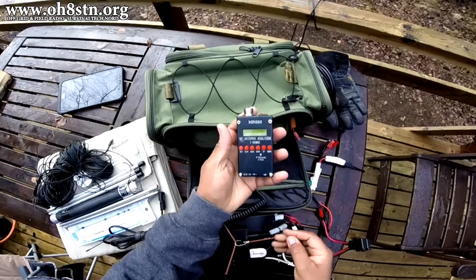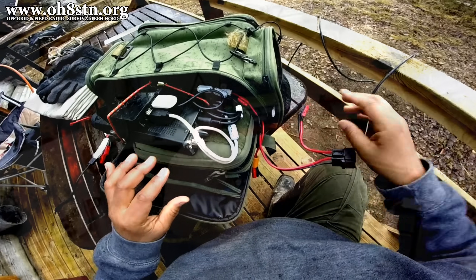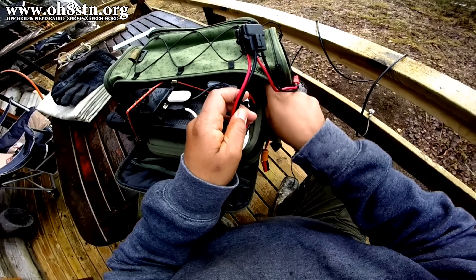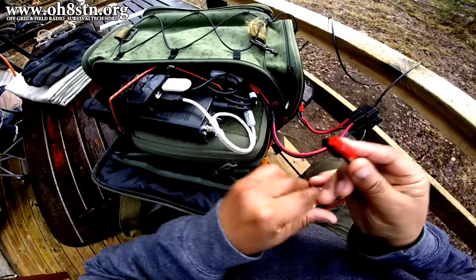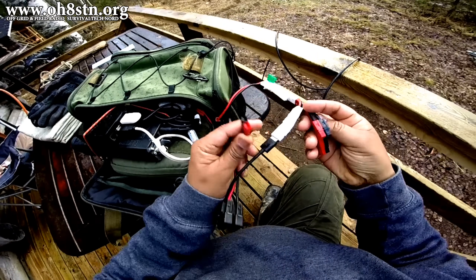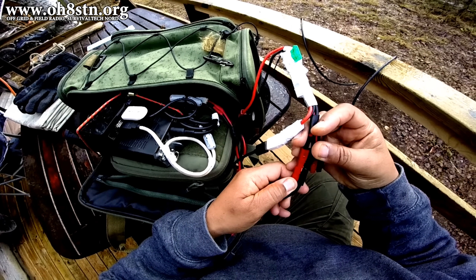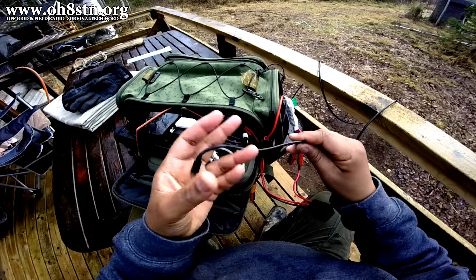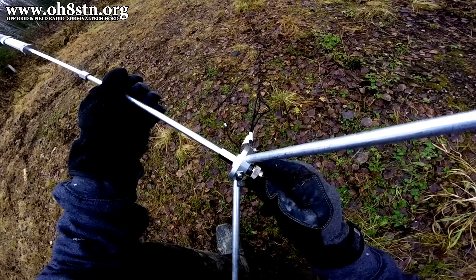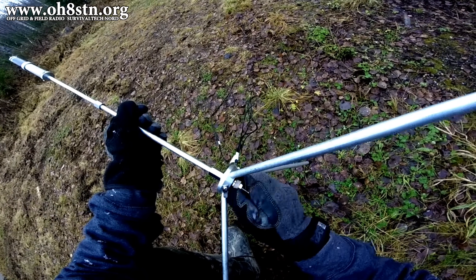Finally, I have the Mini-60 antenna analyzer you've seen on the channel before, but only because I forgot to take it out of the bag — I didn't actually need it for this trip. Setting up and starting up the station is very simple. I start by connecting the power distribution cable to the discharge cable on the battery pack, then the cable for the Yaesu FT-891 to one of the leads on the power distribution cable. Then I plug in the Raspberry Pi using the inline DC-DC buck. The Raspberry Pi will start up automatically, get a GPS sync, and set the clock. At that point I can go ahead and connect the coaxial cable to the antenna and the other end to the radio.